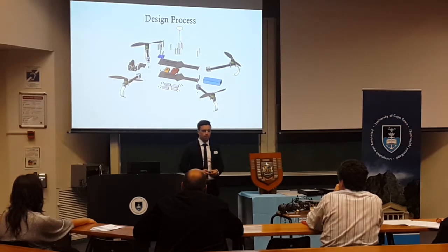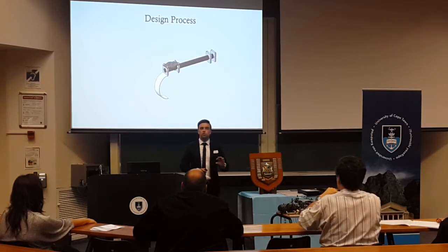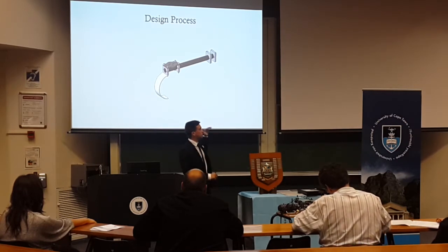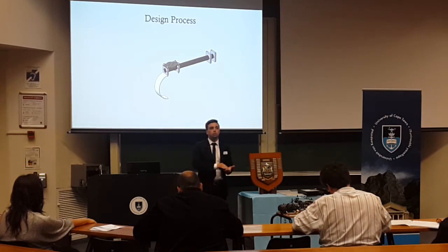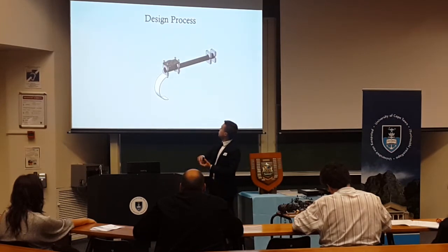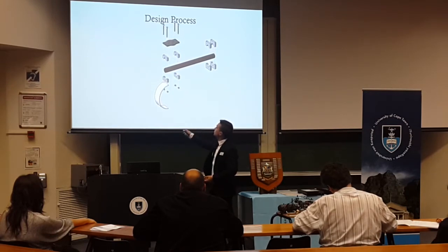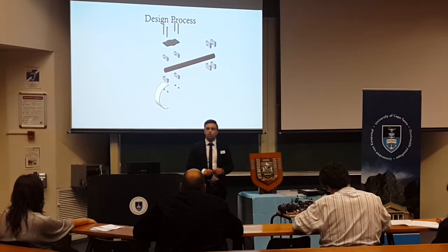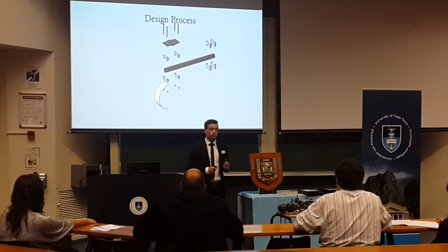In terms of the arm, it's a carbon fiber tube, which I got from a mast builder, and there are blocks of aluminium — because it's difficult to mount a motor to a non-flat surface — so I've clamped the aluminium blocks down on the tubing, and this flat plate is where the motor is mounted. It's really just a sandwich assembly, and this piece of plastic is quite simply a piece of drain pipe from my house, which I cut out — to the displeasure of my parents — and they proved very effective. The design process followed those steps: I modelled everything in 3D in a computer application, submitted those drawings and models to the workshop, and they fabricated them from the materials I gave them.